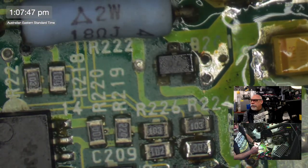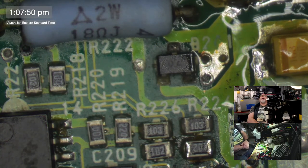Through hole capacitors, but it had nothing for the solder to bind to. Ah, okay, I see what you're saying. So it's kind of like corroded out or something like that. Yeah, look, it's kind of a difficult one. It does depend a lot on that sort of stuff, probably largely on a case by case basis, because sometimes if the hole is rotten through, you can end up in a situation where there are wires on inner layers of the board that aren't making contact. But typically with through hole type stuff, there's often only two layers. It depends if it's a power supply or if it's a motherboard or how old it is, that sort of thing. But a lot of the time what you end up having to do is just get creative.